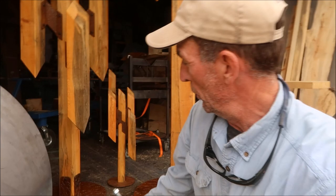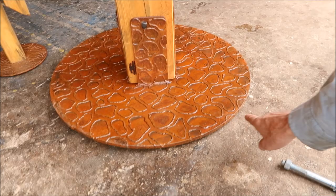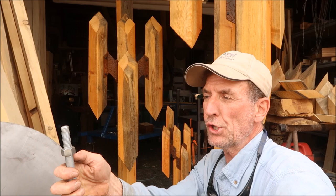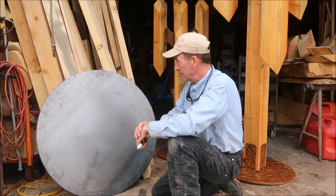One of the things I've run into doing these models is a little bit of warpage that we get when we weld these plates — you can see that it starts to warp. So what we'll do is mount it on top of a nut and washer before we bolt it with another one, and that way we'll be able to level up the plate both ways when we add the eight-by-eight beams or timbers and plumb them in place.